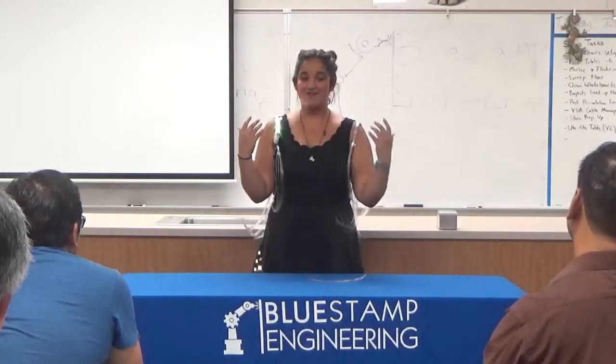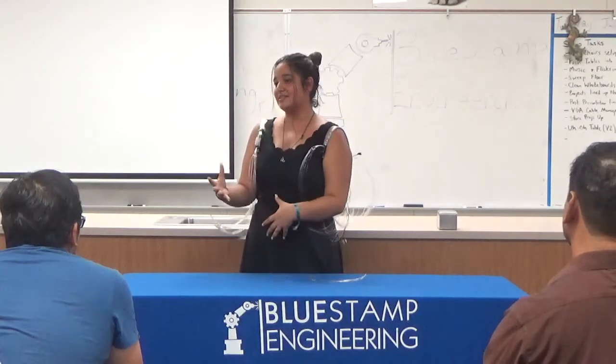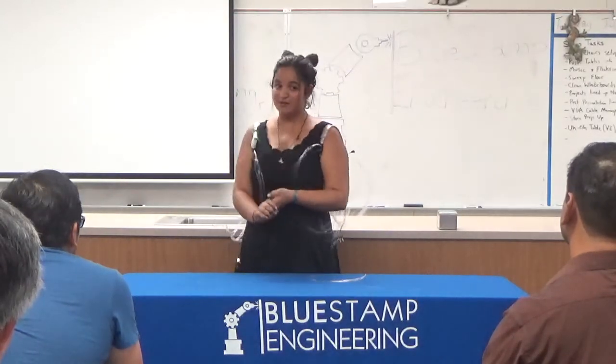And then lastly, I do have a lot of wires all over my project, so it got kind of tedious to identify which is which. One way I made this easier for myself was I took electric tape and I labeled every single wire: either data in, data out, power, or ground.